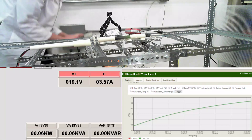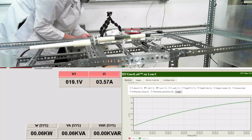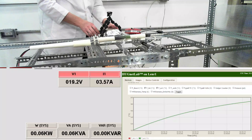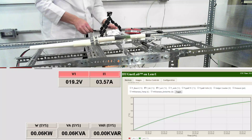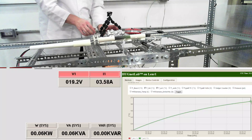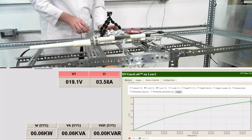Sorry, we lost the camera and a bit of audio there. Moving this USB lead around. So Ryan has moved over the combustible gas detector to see if we are going to be leaking any from this tube, and we're about 188, coming up to 190 degrees in the internal temperature there, which means we're about the peak of the first breakdown of lithium aluminium hydride.